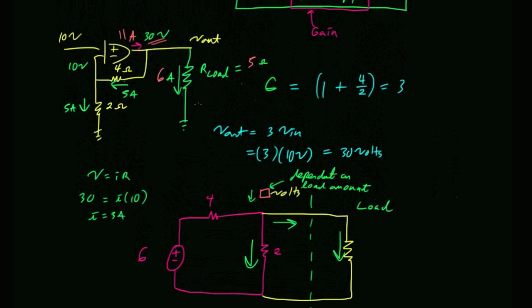At the end of the day, you don't need to re-derive this every time you see it. It's like the voltage divider — you need to derive it approximately one time in your life. After that, just remember: the gain is always 1 plus R2 over R1. Don't mess with it again.